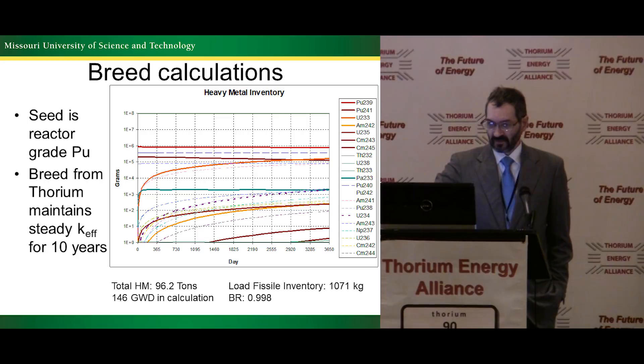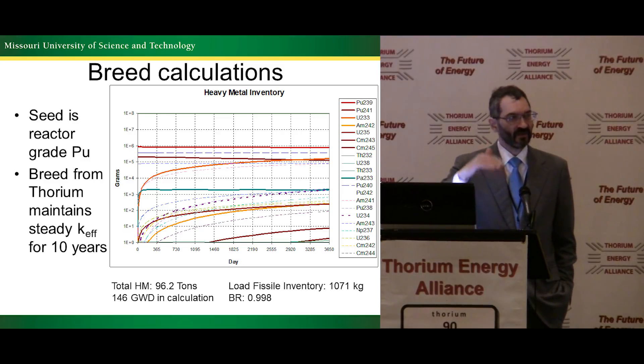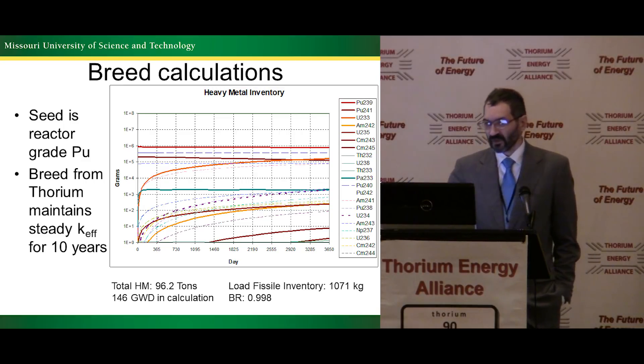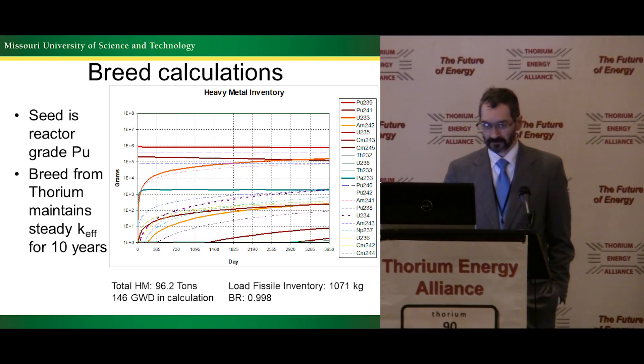The seed is the red and brown lines — those are reactor-grade plutonium lines. You see the plutonium-241 is decaying over the 10 years that this is running. But as that decays, the uranium-233 orange line comes up, and below that is the protactinium line, which is exactly matching our day-to-day burn. Then we have some minor actinides coming up — in this case U-235 is one of the minor actinides, along with americium and curium bred from the plutonium isotopes. This is maintaining a steady K-effective for 10 years, in situ, with no change.